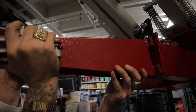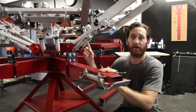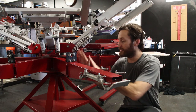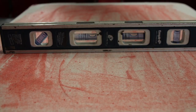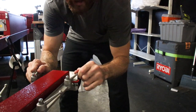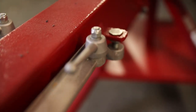Let's talk about the pallet arms first. You're going to take the number one pallet arm and attach it to the carousel arm, work your way around and get all that attached. As long as you get the correct numbers lined up, you're going to have perfectly leveled pallet adapters from the factory. I opted for the M&R style, or slide style, pallet adapters. The reason I choose to go this route is because the used market has tons of offerings in regards to this style of pallet.